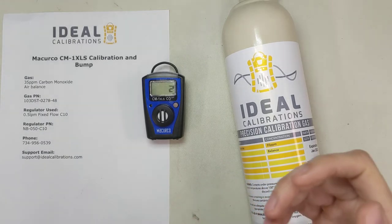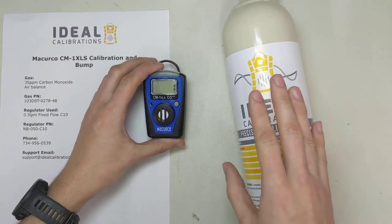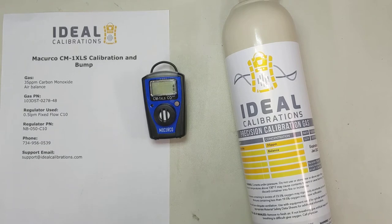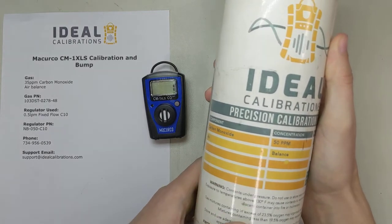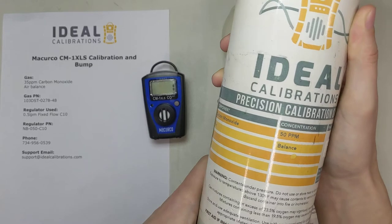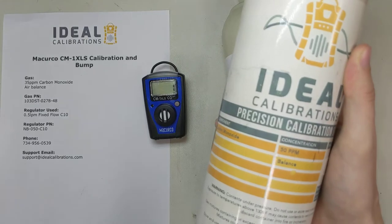That test — you don't want it to take a lot of time in the morning. Put the gas on, set the monitor off — it should take about 20 to 30 seconds. When you have to go the full span all the way up to 100% to set it off, your bump test is now going to take two to three minutes. So my recommendation: if you have this unit, use a different cylinder to bump test rather than the 35 ppm. This is a 50 ppm — this will do the job really quickly. I'm going to do the bump test with this cylinder first to show how long it takes, then with this one to show the difference.